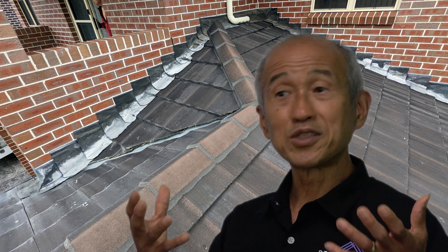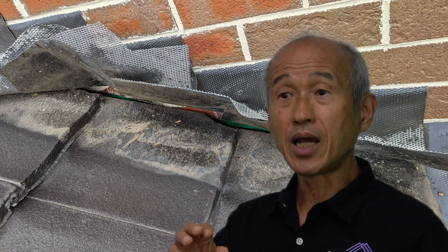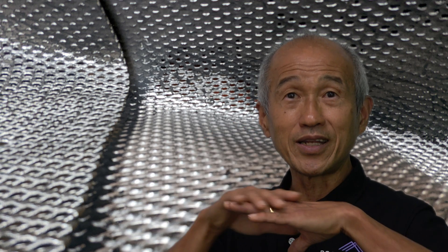The important question is how long will these products last the distance. The other day I got onto a roof where new lead-free flexible flashings had been installed as step flashing and apron flashing, and the flashing was completely disintegrated. The aluminium backing was still there, but you could see only the aluminium mesh with holes right through it — the polymer on either side had disappeared, seemingly eaten away by the weather. It looked much like a Fast Flash flashing, but I couldn't really determine what it was.